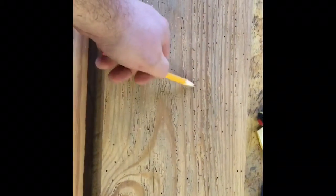So I believe this is pitch pine unless anybody has other information. Board A comes in at 53.7 pounds per cubic foot. Board B is 40.09, which is still pretty high for pine — pine usually ranges from 22 to 31 pounds per cubic foot. Board C, I'm not sure what to make of — it has a little bit of rot and all the wormholes, and I'm guessing there was some density reduction because of that. It goes all the way through the board, and it measured at 30.64 pounds per cubic foot, which is in the rough range of normal pine.